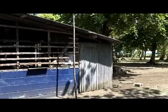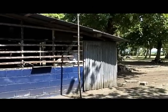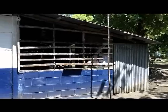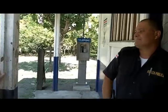So part of the plan is to remove the existing roof, orient the peak of the roof in the opposite direction, and make the building higher in the back where you see that sheet metal and wood slatting. Make it a more uniform looking building with the peak of the roof running east-west rather than north-south.